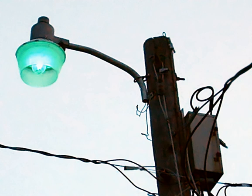Light pollution considerations. For placements where light pollution is of prime importance, for example, an observatory parking lot, low-pressure sodium is preferred. As it emits narrow spectral lines at two very close wavelengths, it is the easiest to filter out. Mercury vapor lamps without any phosphor are second best, they produce only a few distinct mercury lines that need to be filtered out.